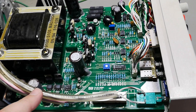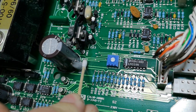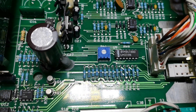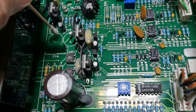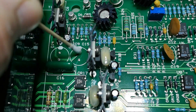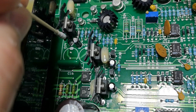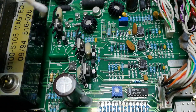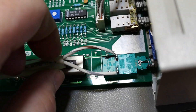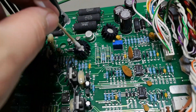Just to prove my point I'm doing the same modifications to the second unit. Around this big capacitor here I had leakage - that big one is also leaked, just like it was in mine. That's probably because it's located very close to the heatsink of U1, so that definitely needs to be replaced. I cleaned it up and will of course put in a new one, then do the same two emitter resistors.